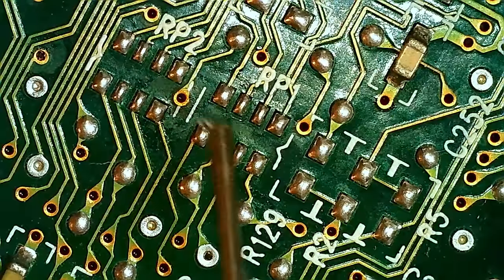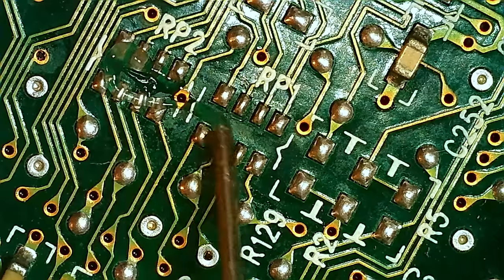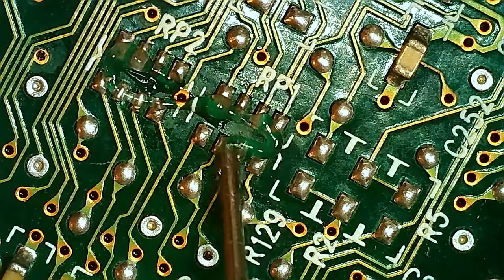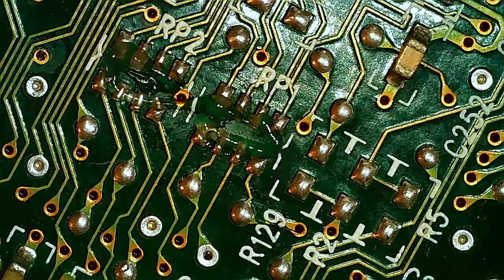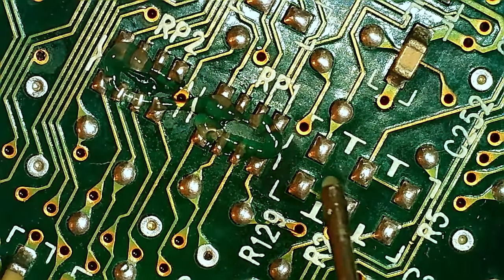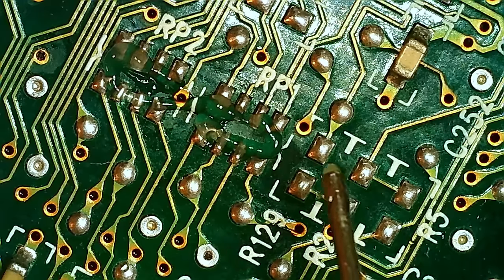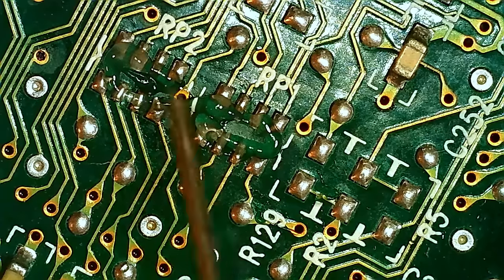First thing to do here is to clean up these pads. So we also need to add some extra resistors here. So I'm gonna have to grab another couple of resistors plus another array, since one was broken more or less. So I need to install two resistors here. I could probably get the right value, so it should probably be 39, but I can get the same type. I can get the resistors off the Voodoo 2, similar to those 22, I think.